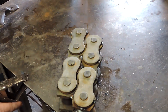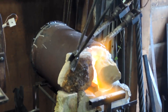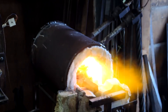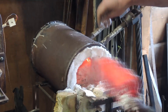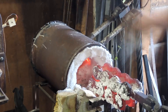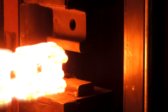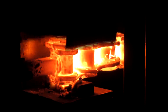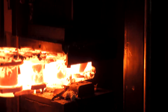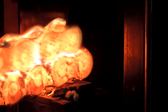We're going to put it in a little bit of alcohol and get some flux on it while it's cold to give ourselves the best chance we can. I cleaned it up with a little bit of brake cleaner to get the grease and oil off of it, just like I did with the last motorcycle chain Damascus video. We also had to take the top die out as it was just too thick and wouldn't fit, so we're just using the top ram and the bottom die.